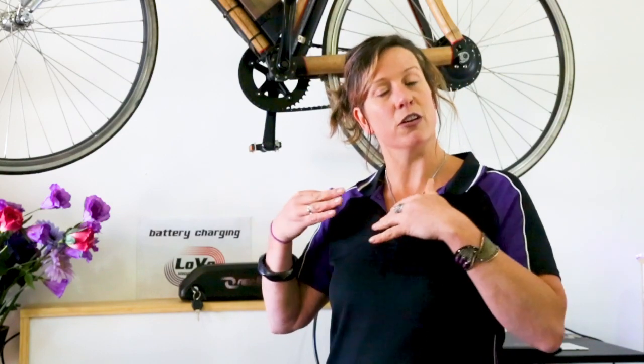Reduce the charging voltage — take the battery off before it's fully charged. That will allow your battery to have a longer life. But you must fully charge it one time in five, so all the cell groups balance out and you retain good long range for your pack.